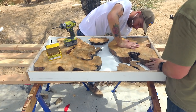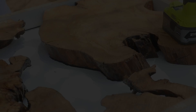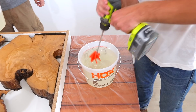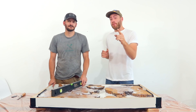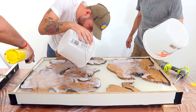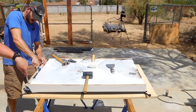Unlike a concrete pour, you're going to want to make sure whatever the top of your table is, is facing up in the form. The epoxy I'm using is called Smooth Cast 310 by Smooth-On. Traditionally it's made for silicone molds for casting and prop making — what intrigued me is that it dries to a pure white without adding any pigments. We did spring a leak on that first pour, but we acted quick, used some Gorilla Tape, and cleaned up all of the seams — crisis averted. Our big mistake was that we should have done one big pour slightly higher than the level of the slabs rather than multiple pours, which would have reduced the bubbles by a ton. Overall though, I am incredibly happy with how it came out. Just something to learn from.